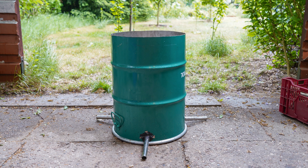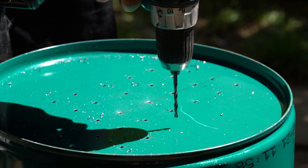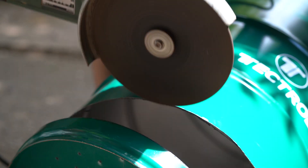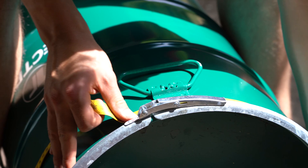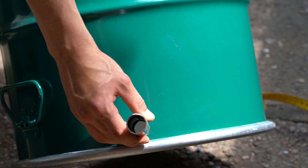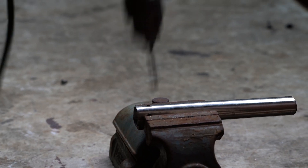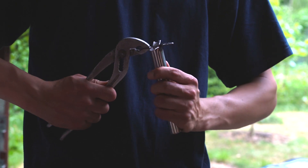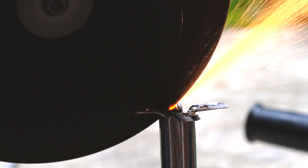The small barrel — the inner chamber. One end of the barrel is slightly narrower than the rest. On this side we drill about 60 evenly spaced holes with the 4 mm drill. We mark a ring around the barrel exactly 5 cm below the surface and saw through it at this height. Now we lay the barrel on its side and drill three holes just above the bottom for the metal pipes, with a distance of 40 cm to each other. We widen the holes with the drill and the file until the inner diameter of the metal pipes is reached. We clamp the metal tubes one after another in the vise and pierce them 4 times about 1 cm before the end. Now we cut into the end of each tube with the angle grinder twice about 2 cm deep. We bend the resulting wings to the side, place the tube upright, and hit the wings smoothly with the hammer. The wing that has turned out the worst is sawed off.